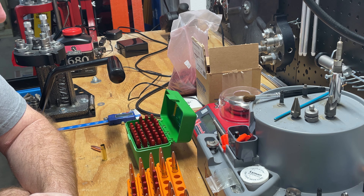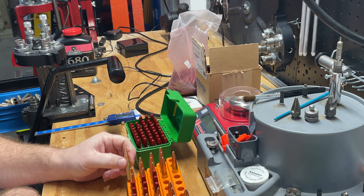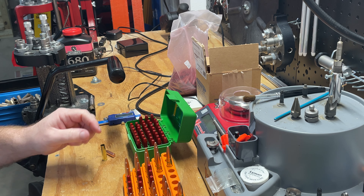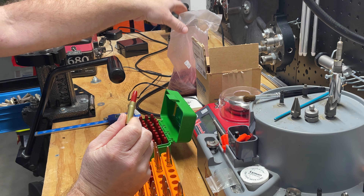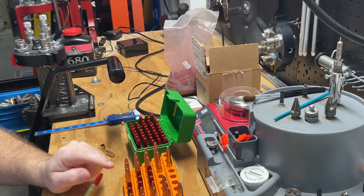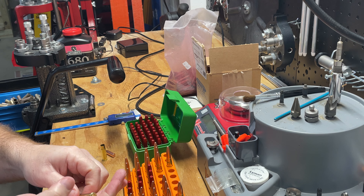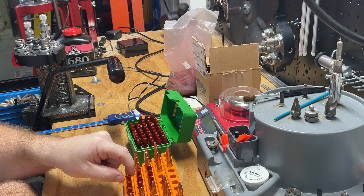After finding that out and correcting my mistake, I came back to reload more 300 Blackout rounds. These are all chambered — they fit my case gauge nice and loose. One thing I will say about the Acme bullets: I will not be buying any more of these. I've got about 150 left. I had to redo a couple because they would not go into my case gauge freely like this one does. A couple I had to force in, and that's a no-go.